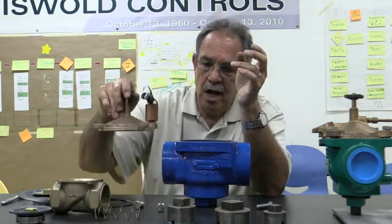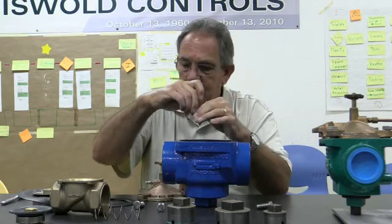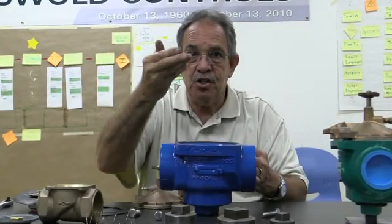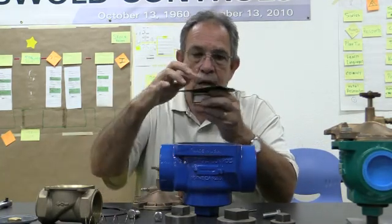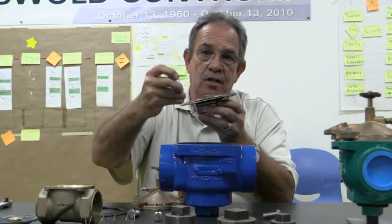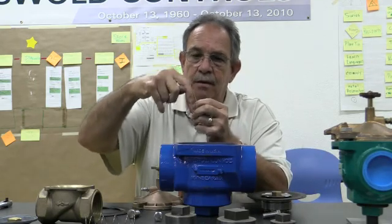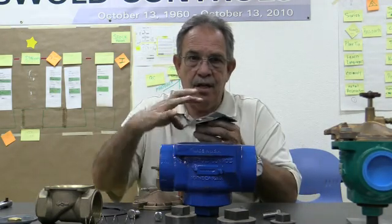Early on in my presentation, I talked about the fact that we have the continuously self-cleaning valve. As I said, that water comes up through the center of our diaphragm assembly. When it hits the guide tube, that water wraps around the guide tube and pushes up through the center of the valve, up through our diaphragm assembly, hitting our metering pin. This metering pin looks like a screw, like I said. As that water's being pushed up, it will start swirling like a tortuous path emitter, and as it does that, we're creating a turbulence on top of the diaphragm assembly.